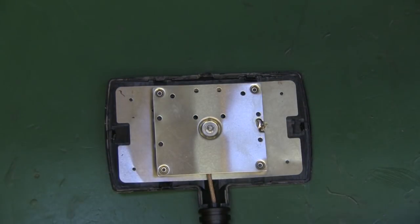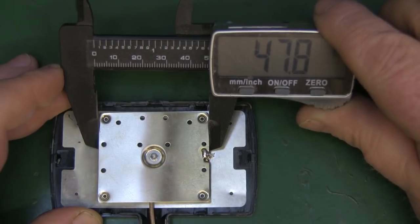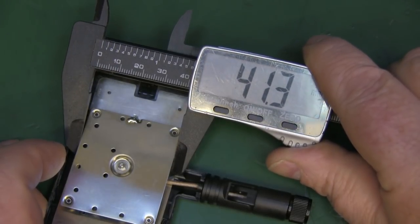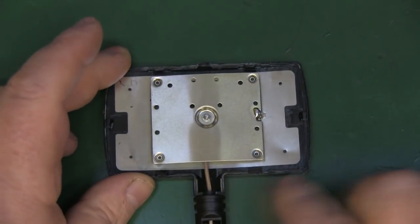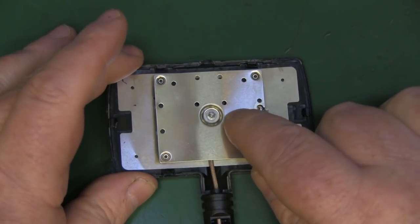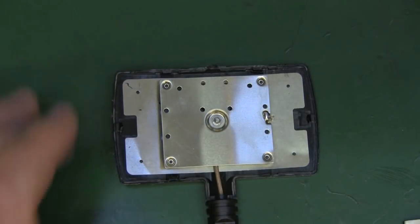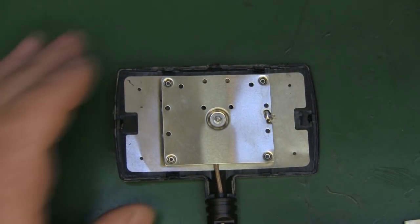Let's get some measurements of this driven element. At its widest it's 47.8 millimetres wide, and top to bottom it's 41.4 millimetres high. That's a typical measurement for a single driven element panel antenna like this. If you did cut the feed down so you had your feed point somewhere in the middle, you would get a better VSWR — normally you'd come up at the bottom and do that. But it's cheap — £3.50 free shipping from China — and it does work at around 8 dBi.